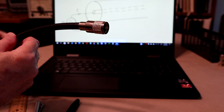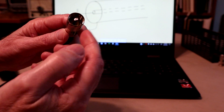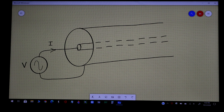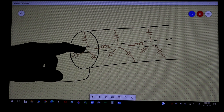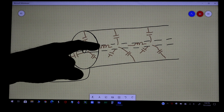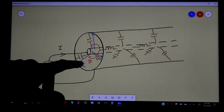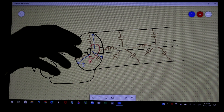Here's an example: a piece of RG8 coax with a PL259 connector on the end - the entire system is coaxial. When current flows in it, even if the other end is not connected to anything, some current will flow into this coax. That's because the coax itself is made of conductors which exhibit capacitance - two different conductors, the center and the outer, with capacitance between them. As current flows down the center conductor, a magnetic field develops and that creates inductance.